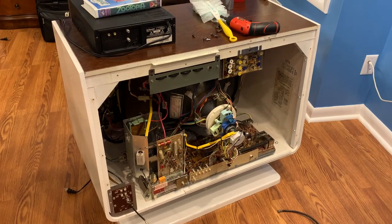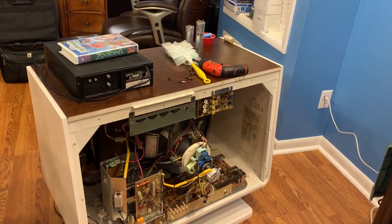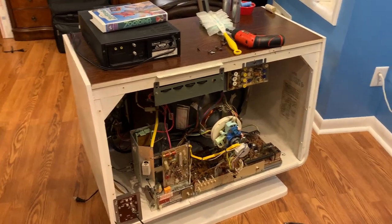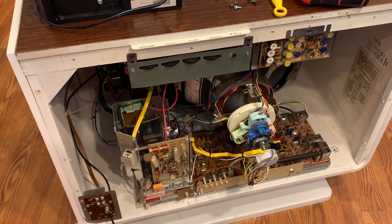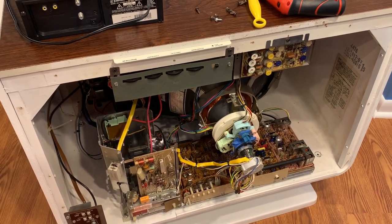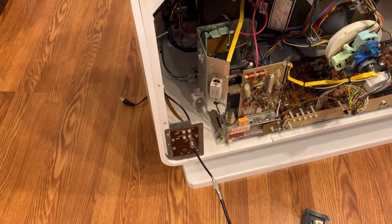This TV is from the 1975 model year, and even my grandfather's was manufactured November 1975, so I will say it's a 1976 model, with many 1975 parts. The chassis is very similar between the two, but on his, the flyback and high voltage supplies were on the right side, but incoming power was still on the left, but the boards are very similar. And there's probably many more differences. It's been almost 23 years since I've been in that, but I'm just so glad it's almost the same TV and the memories flip back. And also the antenna terminals are moved up.